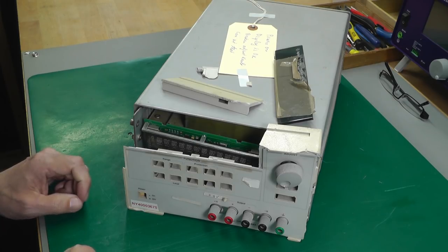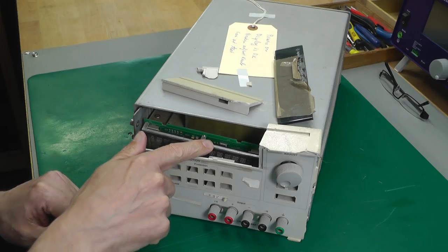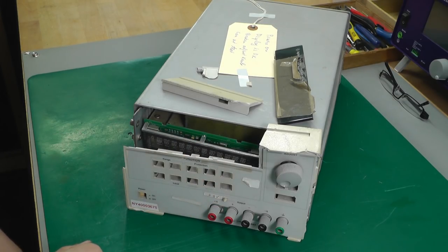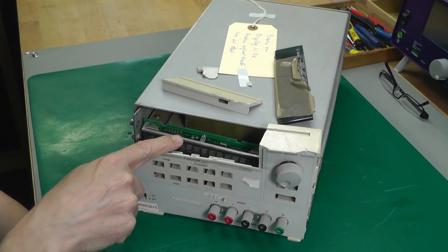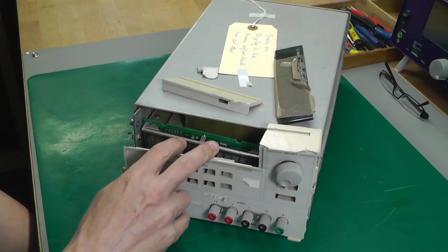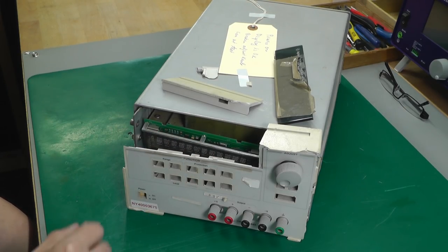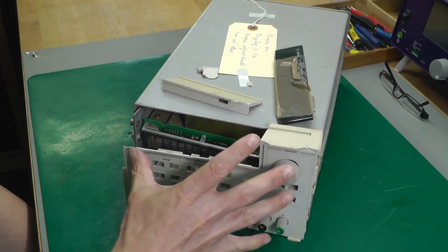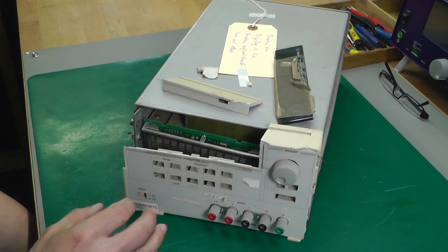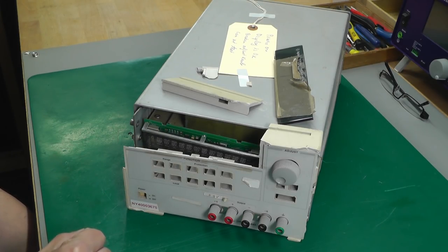You probably can't see it too clearly on camera but the front is actually shoved in a bit. The circuit board at the back is at a weird angle, pushed in at the bottom, so it's just in a bit of a state. Crucially, the photographs on the ad showed the unit powered up in this state with something reading on the VFD, so I know the VFD is good — I wouldn't have bought it otherwise. You can actually buy replacement front panels, so I've got one of those and I'll be able to retrofit it, stripping it down and transferring the rubber membrane, circuit board, etc.